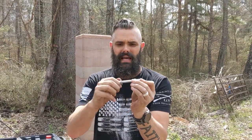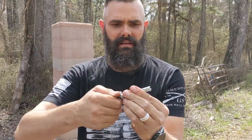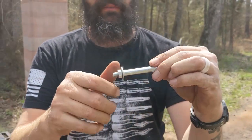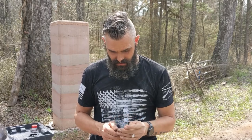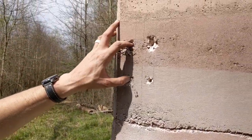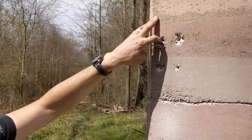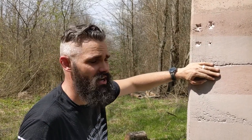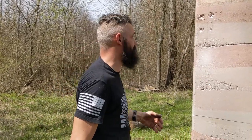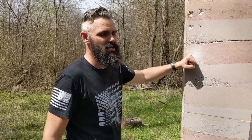So we got all the holes drilled. It's definitely a lot harder to control where that hole lands than I thought. But hopefully, because it grips from the back — the way these anchors work, as you screw in it flares the end out — it's gripping from the back, so the front should have some wiggle room. These are weaker parts in the wall and it just broke out on the surface, but as I got deep it actually grabbed. This rammed earth is hard stuff — it's harder to get through than the concrete foundation, so that's encouraging.